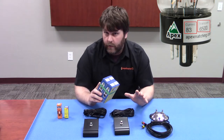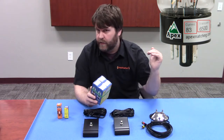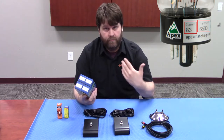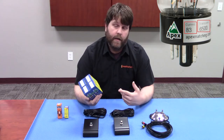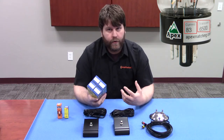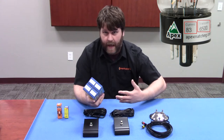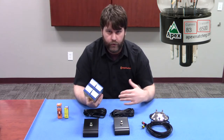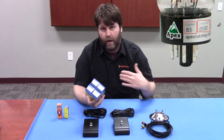If you want something in the middle — a lot of Fender amps and Mesa Boogie amps like those nice middle-of-the-road numbers — you're going to want to use middle numbers on your plate current and transconductance. And if you want really early power tube breakup, you want that tube saturation at a lower level, then you'll want to get low numbers — low transconductance and low plate current. That'll give you easier access to power tube breakup.